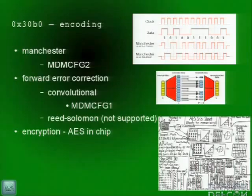In the top one, there's Manchester encoding according to GE. And then on the bottom, in the opposite fashion, who knows why, patents probably, the exact opposite, which is put out by some hack known as IEEE 802.3. The idea being, though, you've got a consistent transition that provides its own clock, and synchronization problems go away a lot easier with Manchester than any other.